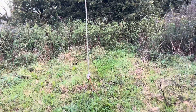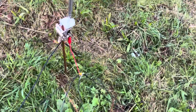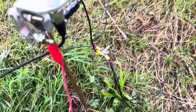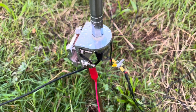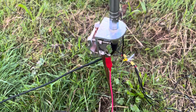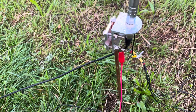Over here we've got the quarter wave - bit of a lash-up job. There are our radials; we're using the trusty ground spike and attached some jumpers into some radials. Total radials used: something in the region of about 32 metres in total of ground radials. They're all quite short, about 2 to 2.5 metres long. So we're kind of using four bunches of four 2-metre radials.